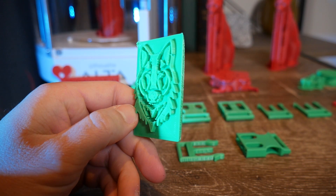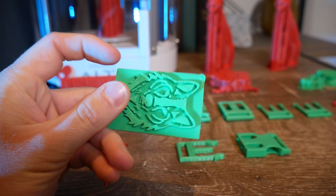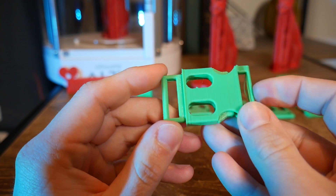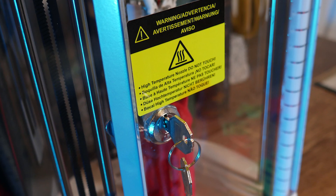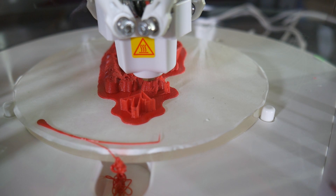I tried printing some forming tools at 100% density for strength, and sadly the PLA did warp at this density, which does happen on an unheated bed even in PLA. I'd stick with the default infill for optimum results, especially if you're just getting started. The printing is pretty quick, partly due to it being a delta and partly due to the tiny print volume. Quality of smaller prints was okay, not amazing — stringing is a little bit of an issue. They do have a good online tutorial series that mentions opening the door to let air in if you have stringing issues. I also want to note this door has a key, which could be pretty cool in a school environment to keep kids away from the hot end and moving components.